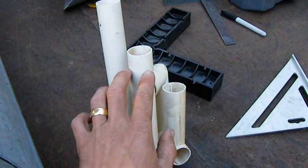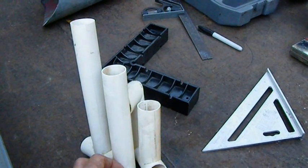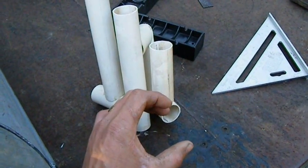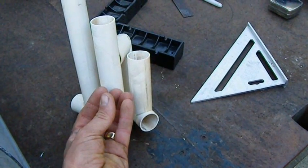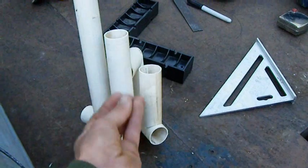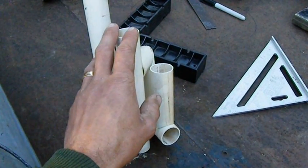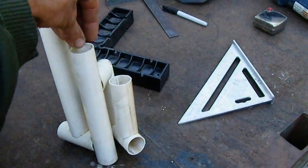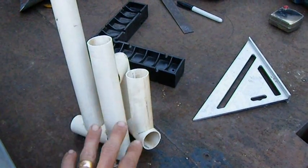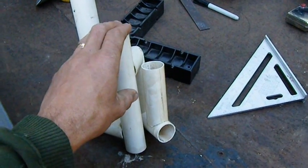For the heat exchanger, I'm going to do a shotgun-style heat exchanger — a manifold at the top, then a whole handful of parallel half-inch tubes straight up and down, and then another manifold at the bottom. I'll have a large diameter pipe at the bottom and top, breaking up into smaller diameter pipes to facilitate heat exchange, just like an old-fashioned steam boiler. That straight run of pipe is going to make it easy to flow a volume of water by thermosiphon, no pumping necessary. The heat exchanger will be removable — I'll be able to slide it in and seal either end, and pull it out to clean it or redesign it if needed.